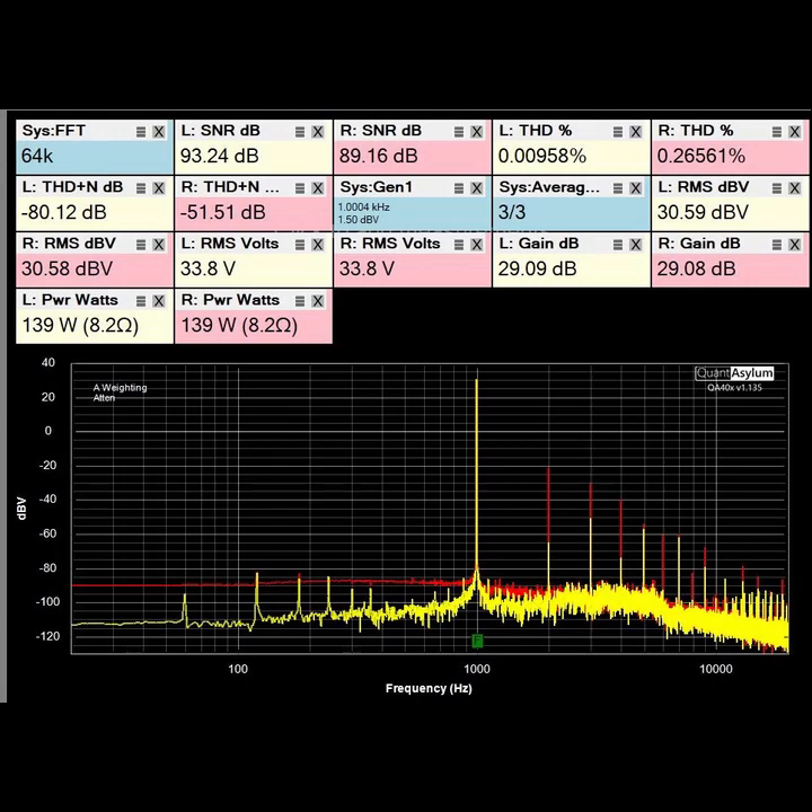I listened to various music tracks from my normal test CD on my KEF 107s. The Marantz sounded fine and I did not notice any of the noise predominant in the right channel. I played it loud enough to reach over 90 dB SPL and preferred to have the loudness and the equalizer switched on. I also did not notice any thumps when the unit was powered on or off. I listened to the FM tuner briefly and it sounded okay. There are three bias output adjustments per channel, but without the service manual they could not be set. While testing the power amp at about 28 watts into 8 ohms for 30 minutes, the heat sink did get hot — about 160°F — however the receiver seemed to run cool during an hour of my listening test.